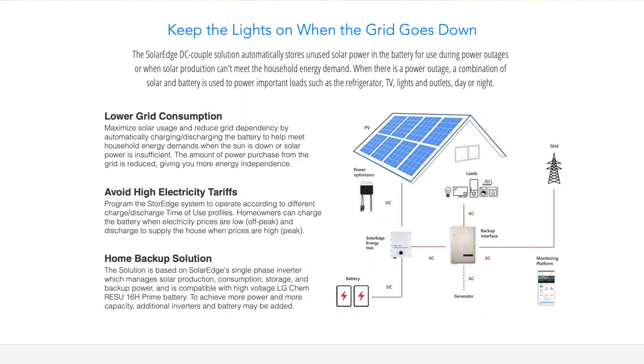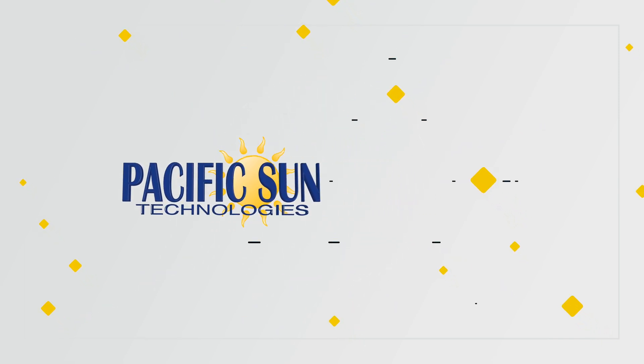Another advantage is we're doing two inverters — specifically two of SolarEdge's 7600 Energy Hub inverters. What this allows us to do is not oversize these inverters but pair them up perfectly with two strings from each part of the array. Each one is going to have roughly about 23 modules, maybe 24 and 22 respectively. Now each inverter is also going to have its own battery.